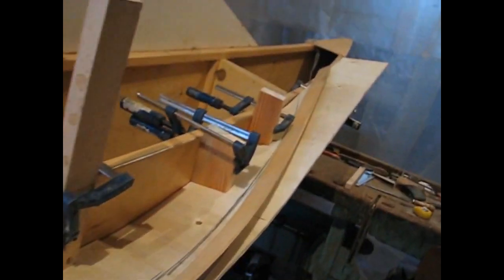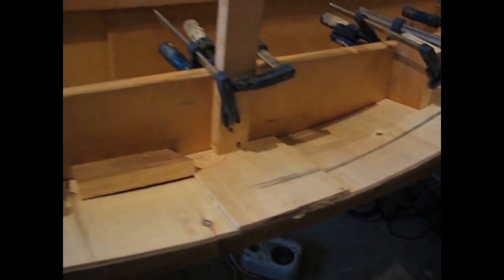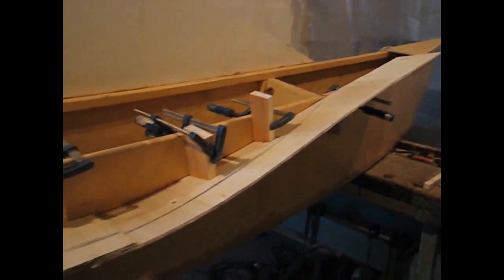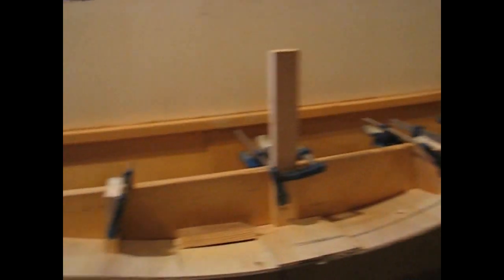Using all the hands I have, I managed somehow with this batten to scrub out this line. That's my cut line — I'm going to cut it now. I'm going to use this half, the offcut, as the template for the next side. It's very difficult to get two identical sides when you're using battens, so I usually do one side and then find a way to copy it over.